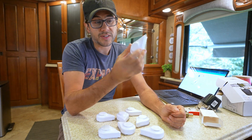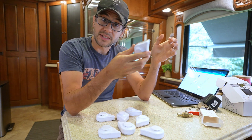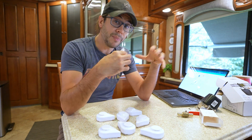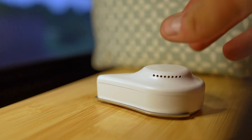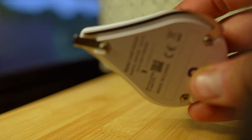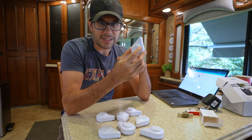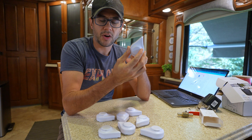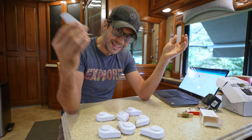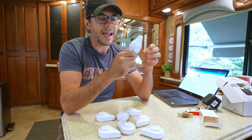These are a little more expensive — about $20 a piece — and they have a wireless radio that can communicate their status so you can do something with it, like turning off the water. This leak detector is from Third Reality and has a Zigbee-based radio in it, which is a very low-powered radio that allows the battery to last a very long time — I've heard up to three years even with wireless transmission. The Zigbee radio does require a special hub, but Zigbee hubs aren't that complicated or expensive.